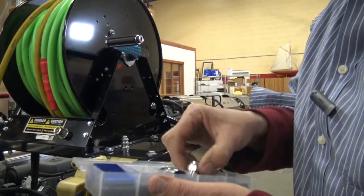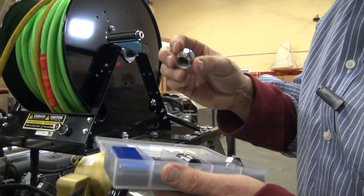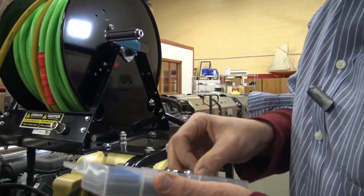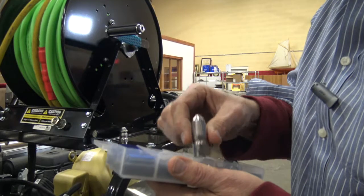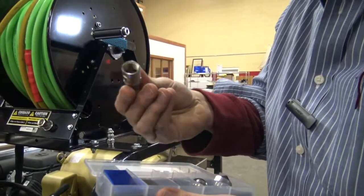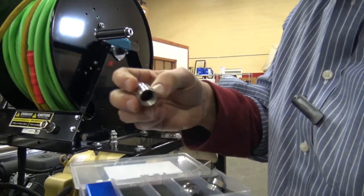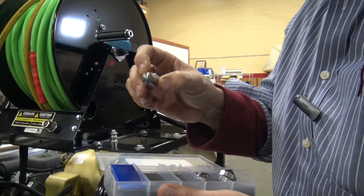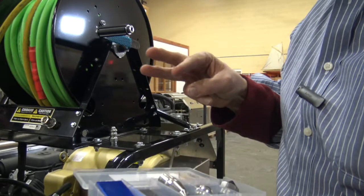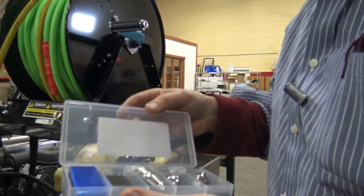For maintenance, I like this nozzle — it pulls itself really well. It's got six nozzles back, so that's your high-velocity puller. The next nozzle they call a degreaser. It's got three nozzles that spray forward and six going back, so it's a two-to-one ratio. It's not going to pull real good, but those front nozzles kind of clean the pipe as you go through. We have other nozzles that can be ordered in addition to this.